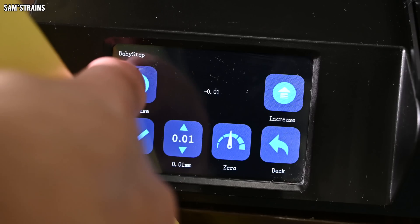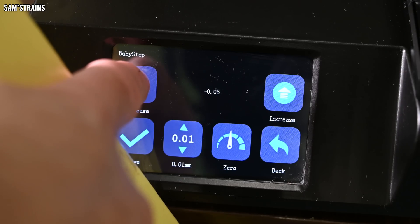You should also adapt your initial layer height depending on the part you're creating. If you're creating something huge with a really large surface area on the bottom then raise the initial layer height, because if you print too close to the bed you'll never get it off. Similarly, if it's something really small just like a little pipe, dial it down a little bit so that you're printing closer to the bed and you're more likely to get good adhesion. There's a lot of information online about improving print quality and slicer settings, but there's not that much on 3D printer maintenance — so now I'm going to give you a few tips on maintaining your 3D printers.